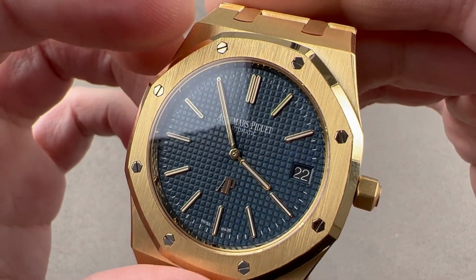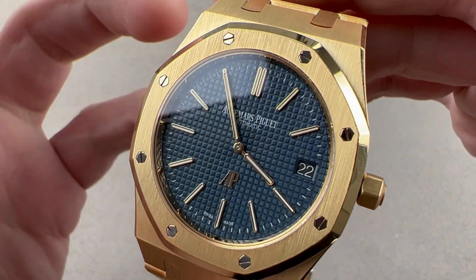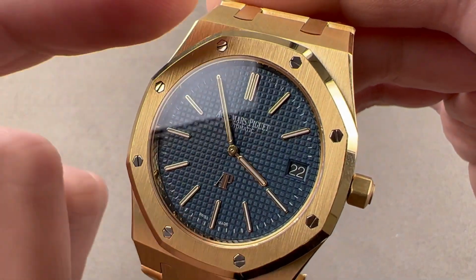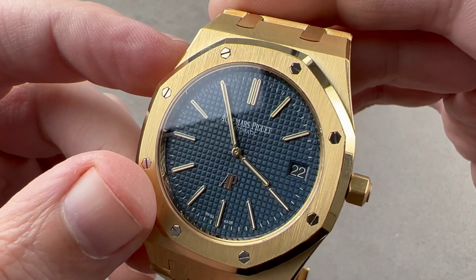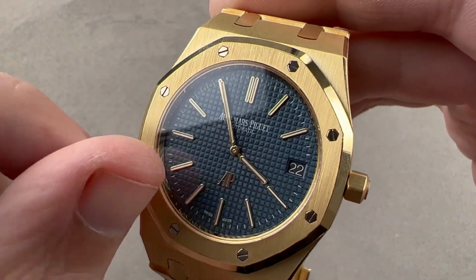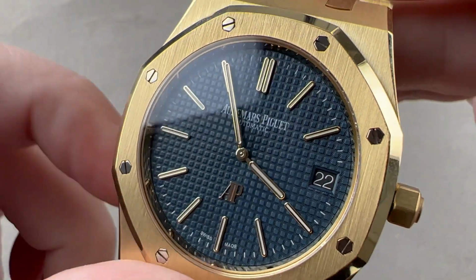Blue hobnail cut on a pantograph. A pantograph is a 19th century mimicry lathe that takes a big template and then duplicates that pattern onto a smaller brass blank that becomes the dial. It is then galvanized blue to create the color you see here. As a result, there are tens of thousands of tiny details on this dial. It's not just the hobnails. The closer you get, the better you appreciate the texture.